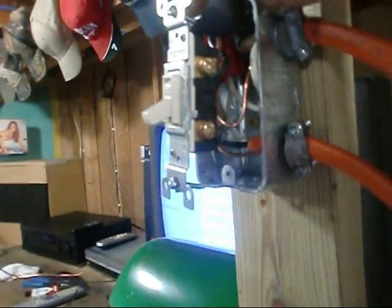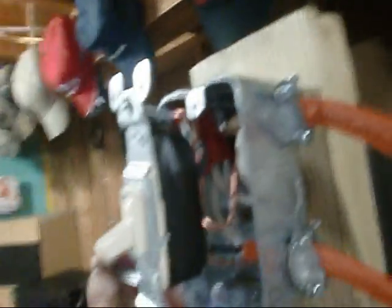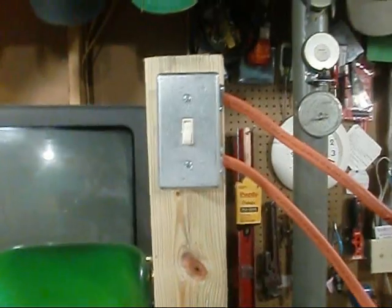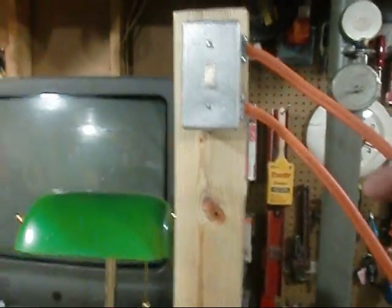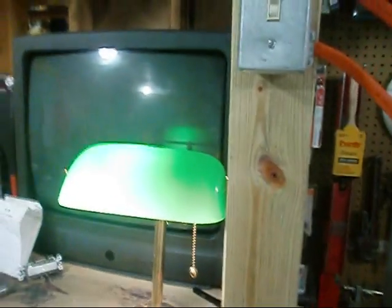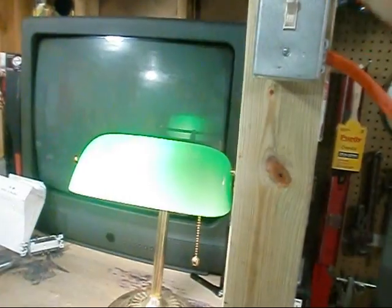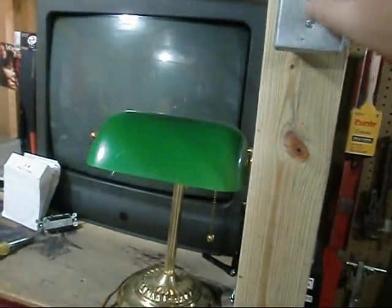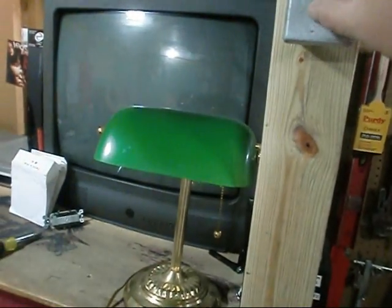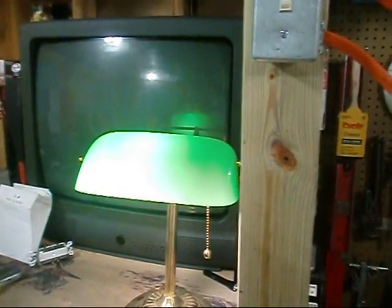One other quick tip: I like to take electrical tape and wrap it around my lugs. See what I'm doing there? That way you don't have any possibility of that thing grounding out against your box. Let's see if our temporary switch here works — going hot. There we go, that's your furnace — on, off, on, off.